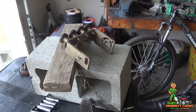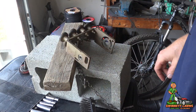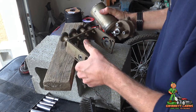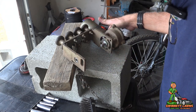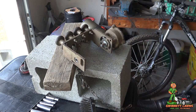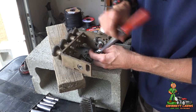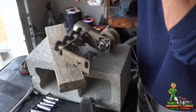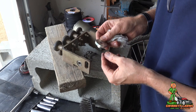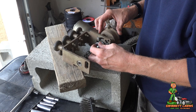It was starting to sprinkle a little bit and we're in here in the garage. So out of all the pieces of this to do, this is where the rubber meets the road. I'm going to take the base — I've just got it set up on my little piece of two by four. What we've got to do is put the bolts in first. So this can still move because we'll have to adjust it later. Now I'm going to take the collar, line it up with the shaft and the woodruff key.